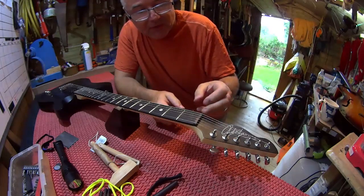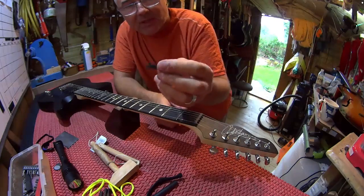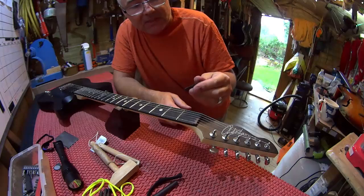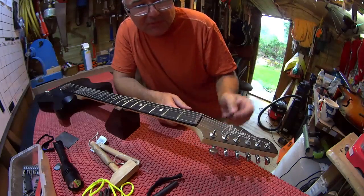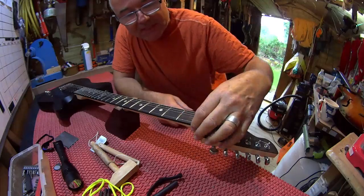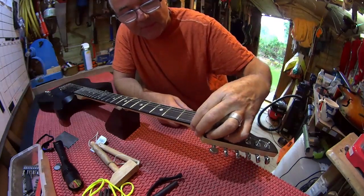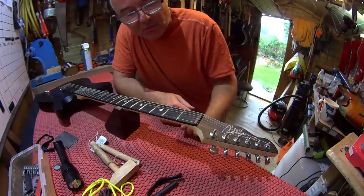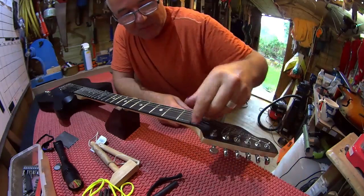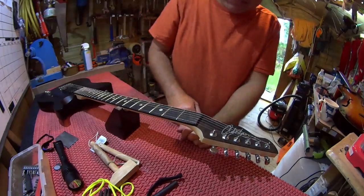What they've done in the factory is they've cut the slot too low to trim this doofer. Either use this one or we'll use the new one, since Luke's will be paying for it, but let's put a new one in. But the point I'm making here is that the slot is cut too deep. So a brand new nut in here doesn't work. It's too low already. It comes off, which explains why it was like that when you got it. So they've miscut it at the factory.